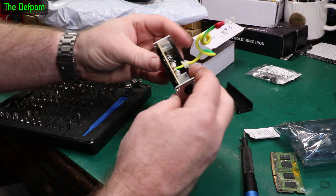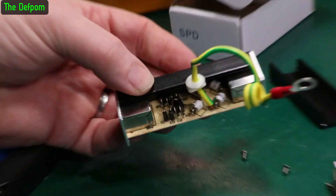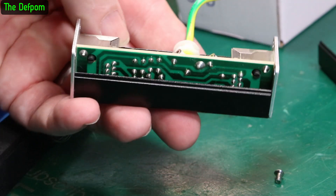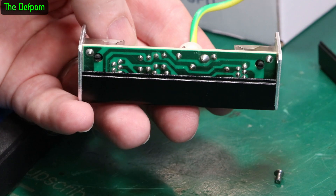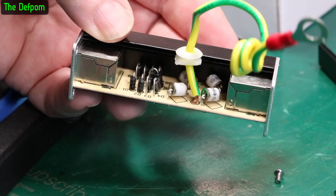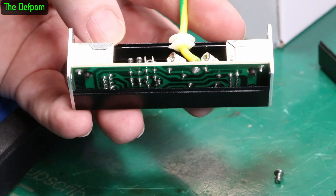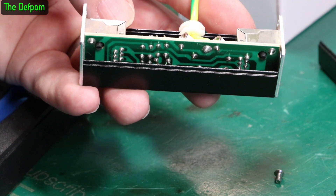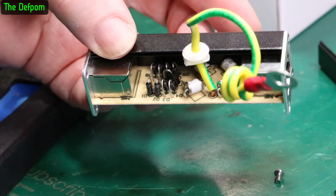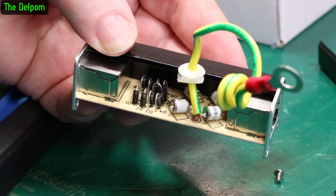There we go. It's one half. It actually has lightning suppressors in it - look at that. Gas discharge tubes and some diodes. I'm actually surprised it's got circuitry in it - I thought it was like an empty box. It actually does what it says. That's impressive. I'm not sure what the diodes are doing, but there's some clamping across. Trying to follow the traces - so I think it's direct connections one to the other with this circuitry across it to snub any surges. Looks right to me.